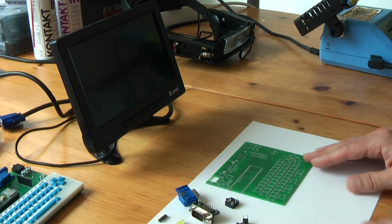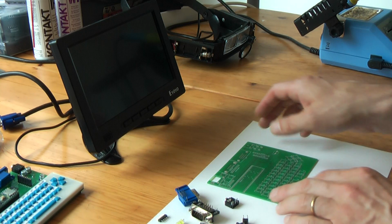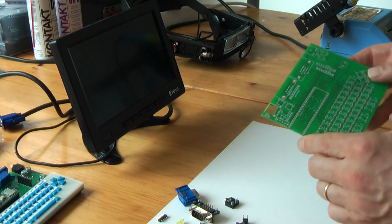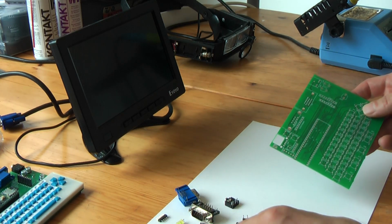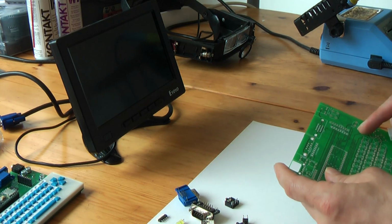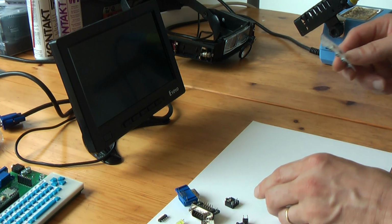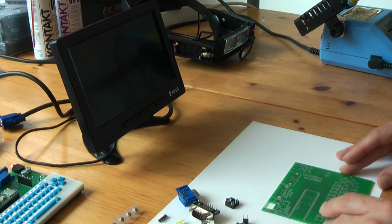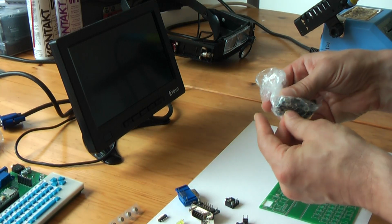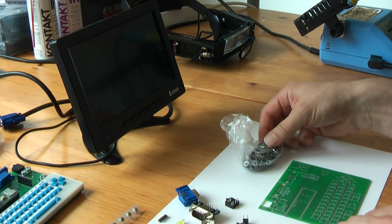So I'm going to speed up everything. You can find the values for the resistors. In fact, everything is indicated on the PCB, so only the polarity of the capacitors I forgot, but normally for these capacitors the black line is the minus, so this will be the ground, and the ground on top goes to the sound output. And of course I forgot, you will need a lot of small keys, small switches that you will have to solder, and that will be the biggest part of the project.